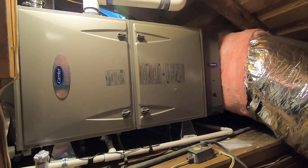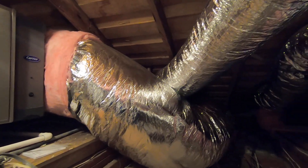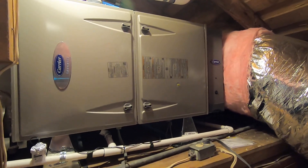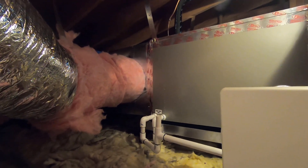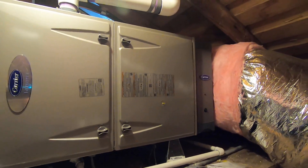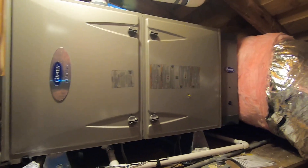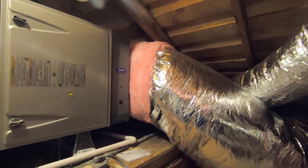This is a 2800 square foot house and we added three zones and reducted everything. With the variable speed furnace and the variable speed condenser outside — which has 75 speeds — this house can control different comfort zones throughout the day. We have a downstairs zone, a master bedroom zone, and an upstairs bedroom zone. Anyone in those zones can program their thermostat or turn it on or off to what they want, and it will be that temperature without cooling or heating the other zones, making for a very comfortable home overall.